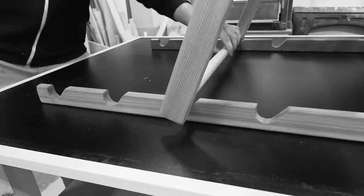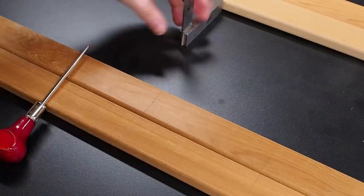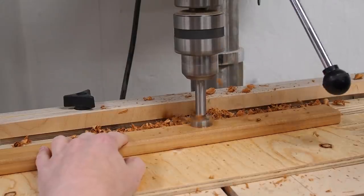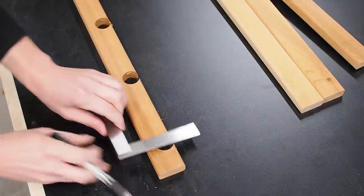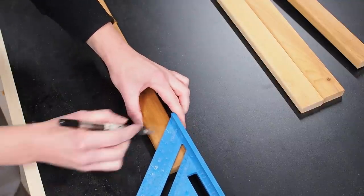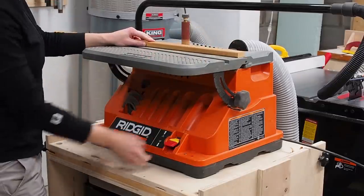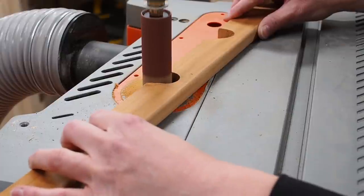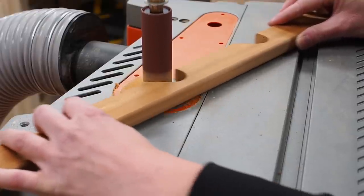Next I want to make these hook slats for the adjustable back. I started by making evenly spaced markings and then transferred those over to a second piece. I then measured half an inch inwards and used an awl to punch a pilot hole. I could then use a Forstner bit to drill the four holes all the way through. To shape the slots the way I want them, I used a square on one side of the hole to make a perpendicular line and used the 45-degree edge of my square to make a line on the other side. I didn't have a bandsaw, so I used a shortcut — shaping the slots using my sander with a spindle attachment. I slowly sanded away, progressively shaping the wood until I reached the lines and was left with the four sculpted hooks.